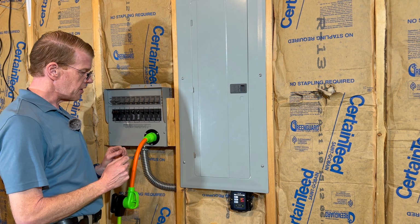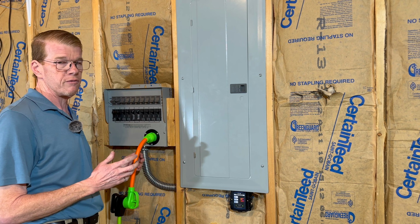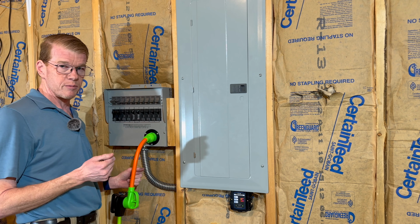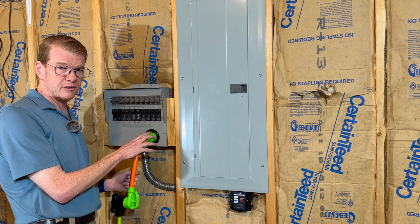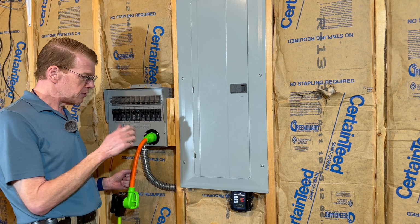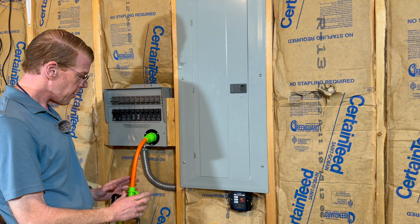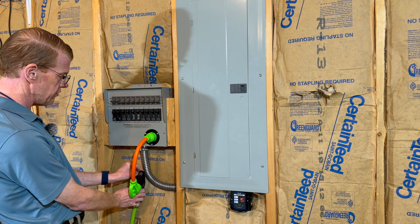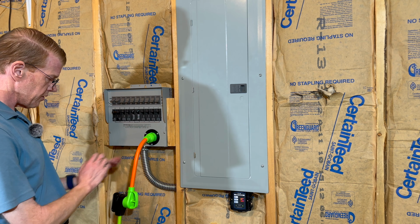Okay, I'm back. I had a second thought. Since the AC300 and all Bluetti products and all portable generators have a floating neutral, I thought it a good precaution to turn off the output, because when I connect it here, it will be bonding the neutral and ground. So I turned off the output, I connected my L1430, I connected my TT30 adapter. I am probably going to make some sort of hook here as a strain relief, or I might even redo this and just come straight out of the bottom with a cord to eliminate all the dangling out the front here.